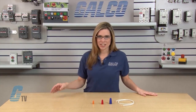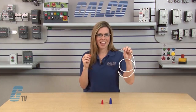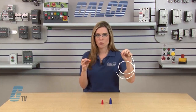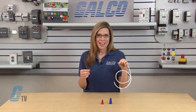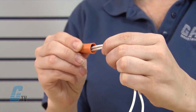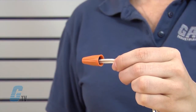For the installation, I will use the orange-blue wire connector. I'll start by holding the stripped wires together with the ends of the insulation even and leave the stranded wire slightly longer. Pre-twisting is not required. Next, I'll align any free strands of the conductor and firmly push the wire into the connector and turn clockwise until tight.